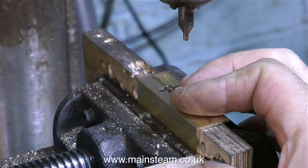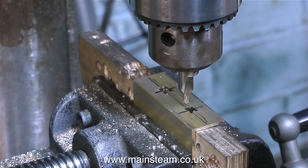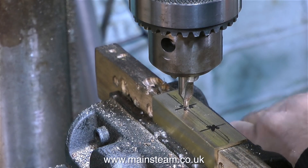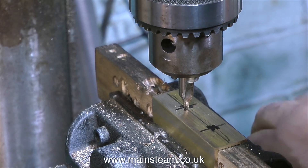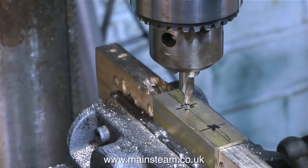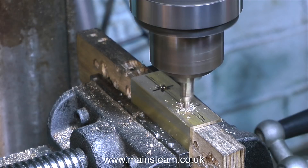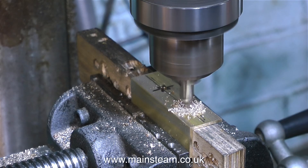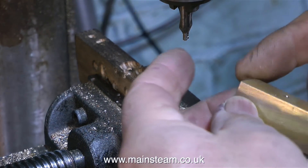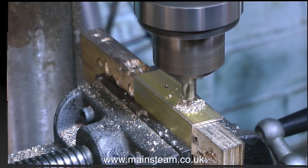In this clip, I've put the original piece of brass back in the machine vise and clamped it from the other end. Now I'm turning the handwheels to move the cross vise into the correct position. This is a simplistic approach: first, I accurately position the point of the centre drill in the original hole — this is surprisingly easy to do. You can feel when it's binding, and you can actually see the tip moving. I then drill the other hole, which is in line with the first one and in the correct position. Without moving the cross vise, I simply fit the other piece of brass in exactly the same way, using a scrap piece of wood to make sure the brass is aligned with the end of the vise jaws.